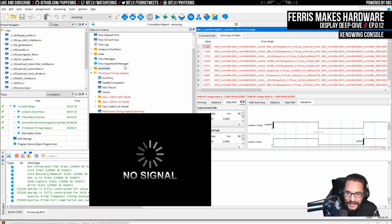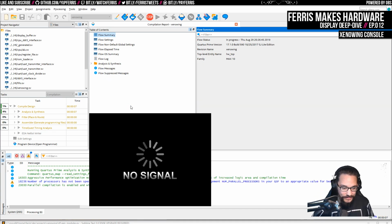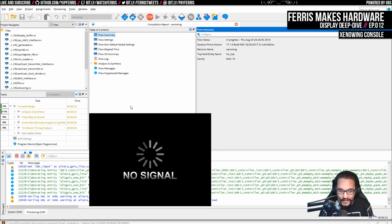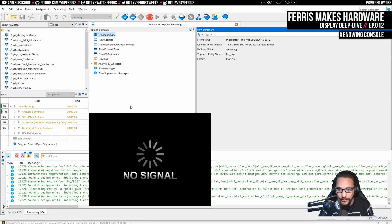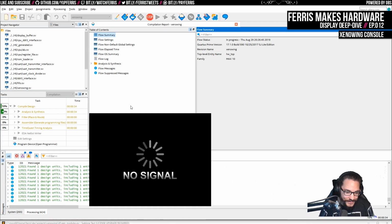So let me just do a recompile with this again, because that's what we had. And if I can verify that that works again, then we can commit and then try to simplify that in a separate thing, which is probably a good idea. I can just amend the commit when we get it working. So the really annoying thing about when this kind of thing fails, it's really hard to know what to do. In this case, I would probably try and maybe snoop the I2C bus in the signal tap analyzer. And then we have slow iteration times, but at least we can see what's happening. That's kind of the worst part about FPGA development in general. Like, I honestly really enjoy the logic part of it.